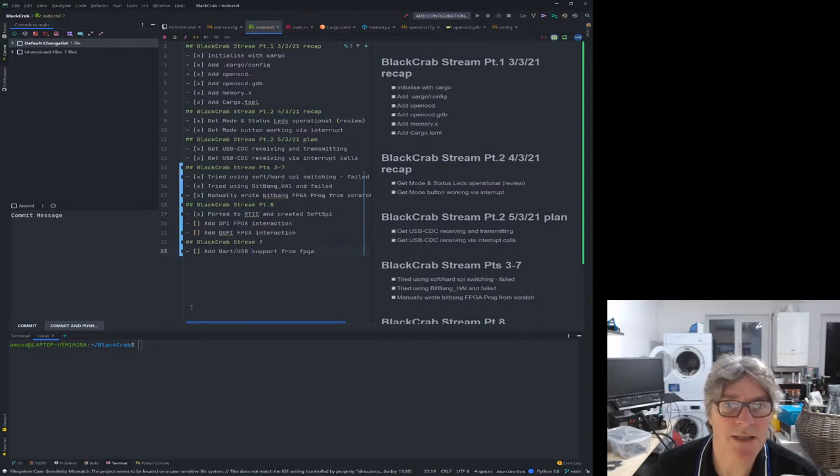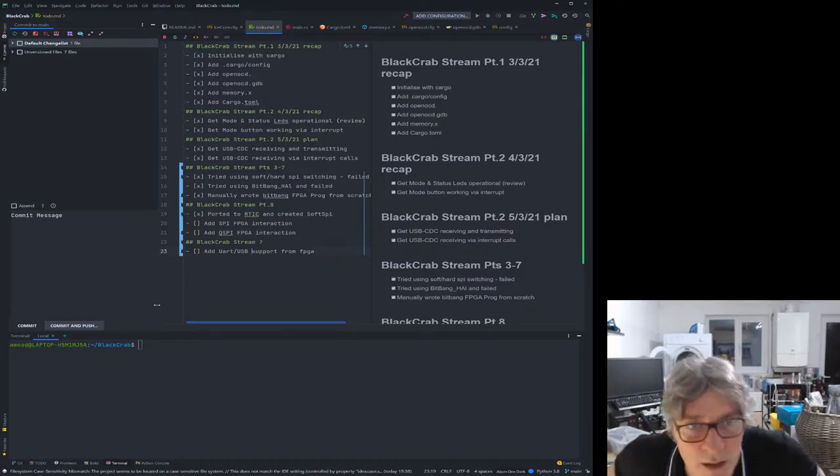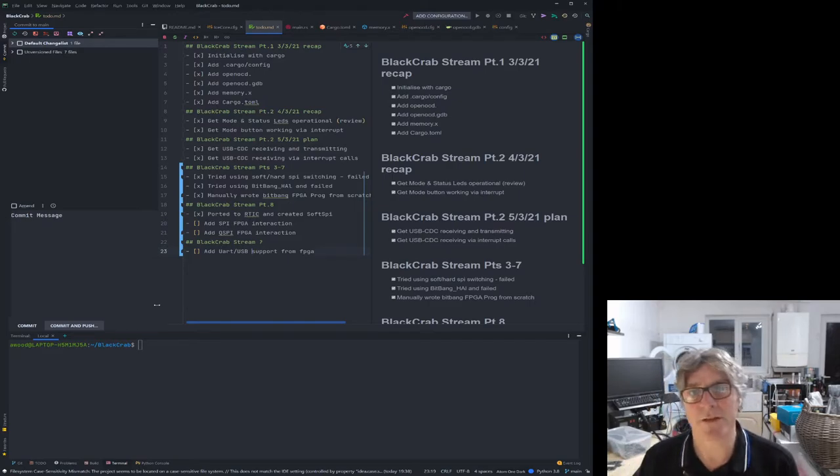The other thing that we've got on there, as well as the SPI that we use for programming, is a QSPI connection. Now, the QSPI connection in this case doesn't go up to quad SPI, it only goes up to dual SPI. But it supports single SPI, dual SPI. And if we had more pins available, it would have supported quad. But weirdly, on the STM32F7, quad SPI wasn't available as a nibble. It was only available as double, i.e. DSPI or single SPI. Which is a bit annoying, but that's what we've got.